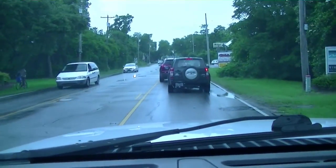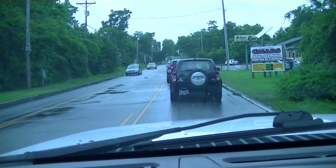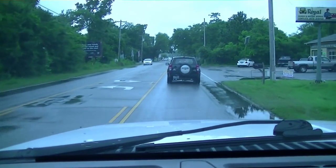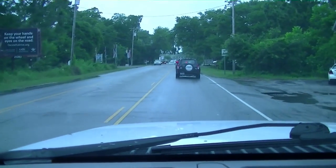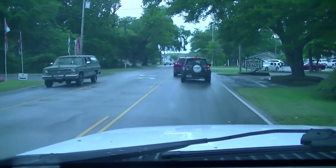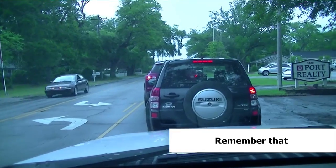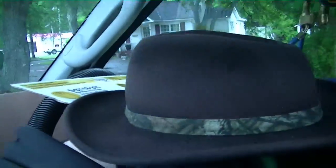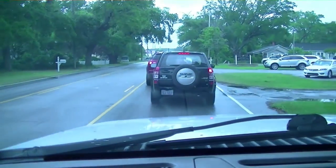I'm leaving my evaporator change-out, sitting in a little bit of small town traffic. Evaporator change-out went fine. I couldn't film the very end of it because it rained on me hard. I put about seven and a half pounds of refrigerant in the machine, charged it to about 21 degrees of superheat, and it was a happy machine. After I changed the capacitor — which was bad and the compressor wasn't starting — I figured it was probably the capacitor. Had to break out the old fedora, which makes me basically feel like Indiana Jones, but that's why I wear it.